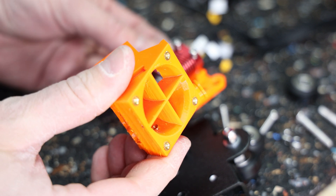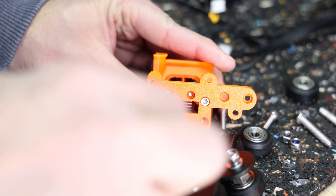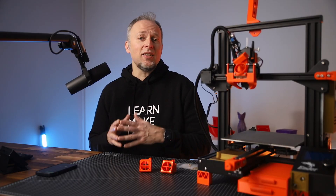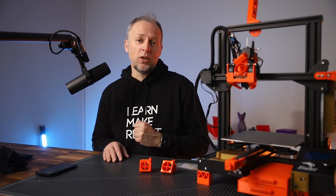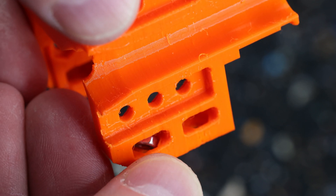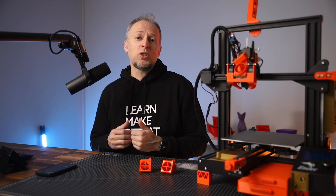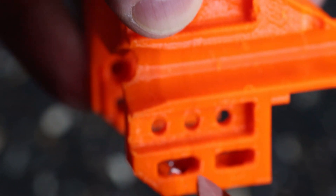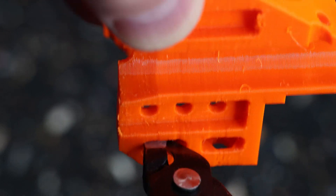The parts that have changed the most significantly are the bases. The bases are attached to your printer using the gantry adapters, and the base essentially holds all the other parts and the hot-end cooling fan. What has been tedious in mounting anything to the base and the base to the gantry adapter was the use of M3 nuts in Hero Me Gen 5 and below. Those M3 nuts had to be inserted in specific places of the base before attaching other parts to it, and some of these places were quite hard to reach. Also, those M3 nuts, at least in my case, tended to be too small for the cutouts so they always fell out during assembly.